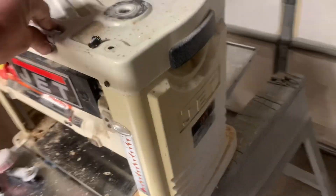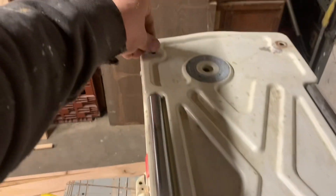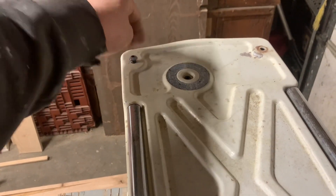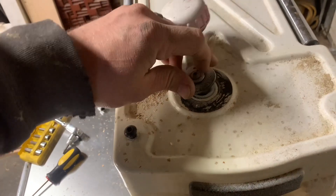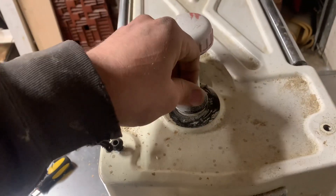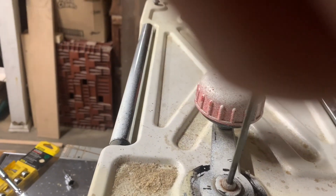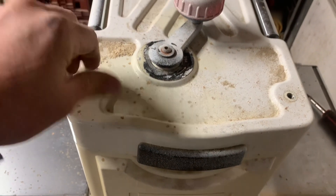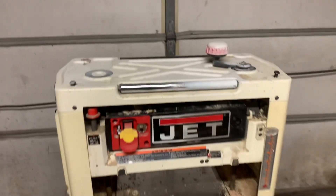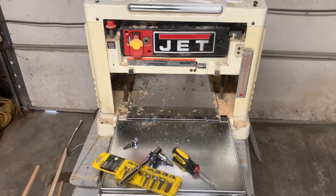If you successfully do it you'll have everything rolling. Get these four bolts put in — remember they're five millimeter. Get them guys started; might have to shake it to make sure they're lined up. Then we can put the crank back on as well — just add the little key on it, and then take your piece from the factory, run that tight, tighten up these guys, and we're good to go. That's how you replace or reverse the blades on a 13-inch Jet planer. Let me know what you think.